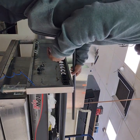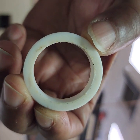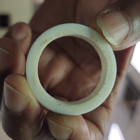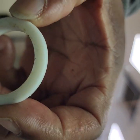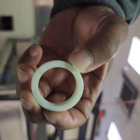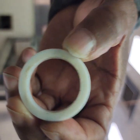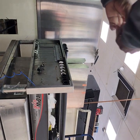See, I pulled the roller out. That's the roller. These right here are the dividers, and what they do is prevent the grease from going along the rollers and dropping into the side. These are pretty good, but they do have to be cleaned often by the store staff. If they're not cleaned regularly, they'll end up leaking grease into the sides of the rollers. I just wanted you to see this part. This is not the actual gear bearings. This is just a divider.